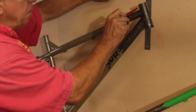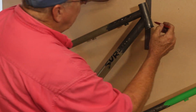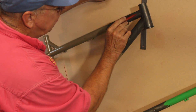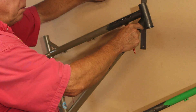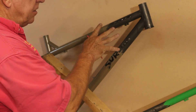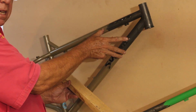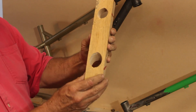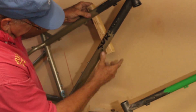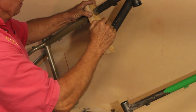We're going to remove the head tube from this frame and the other frame, and install a single vertical head tube tying the two together. I have my protractor at 90 degrees and I've marked a vertical line. The next step is to cut this head tube off, then use my tubing notcher to make new notches for the new vertical head tube. Before that, I want to make a stabilizing clamp because when I break these two welds free, there could be spring tension built up in these two tubes. So I drilled a hole straight in and at the appropriate angle, then bolted that to hold it solid. Then I can cut that off and notch the ends.